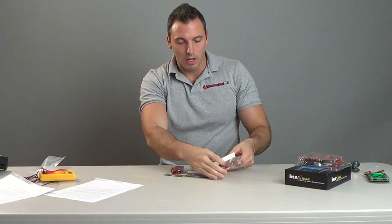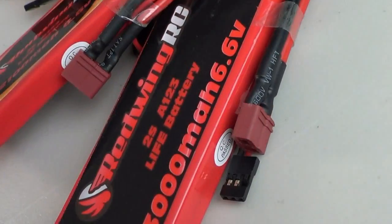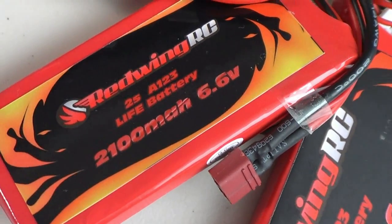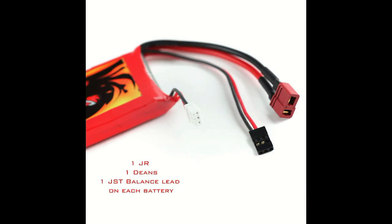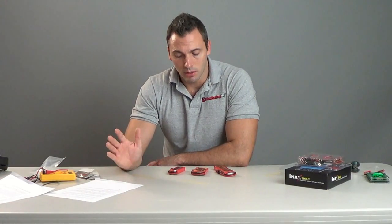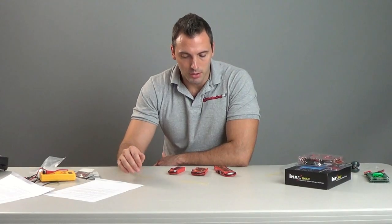Our Red Wing LiFe batteries come in three sizes: a 3,000 milliamp, a 2,100 milliamp, and a 1,450 milliamp. All of our batteries come with both a Dean style and JR style connector, as well as a balancing lead. It is important to balance LiFe batteries whenever you have the opportunity. You can occasionally just fast charge them, but we recommend balancing them when possible.